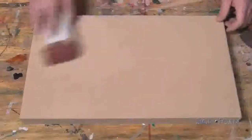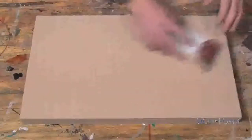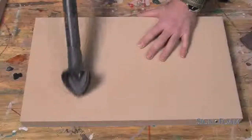Circular patterns are efficient and do a good job of even coverage, but back and forth or up and down patterns are an option as well. Sanding sign foam is fast — a whole four foot by eight foot sheet should only take about five minutes or so. What little dust there is with sign foam can be removed with a brush or with a vacuum with a brush attachment.